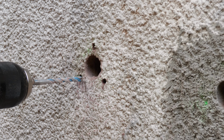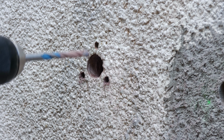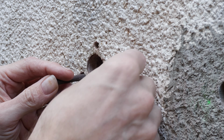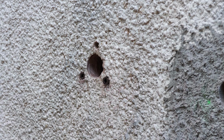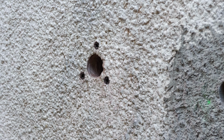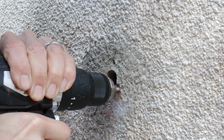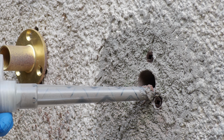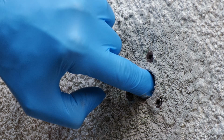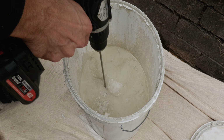And as the brass screws I had lying around have quite a wide neck, I even slightly widened the start of the hole to 8mm to minimise the chance of the screws blowing the render. As with the 24mm diameter hole for the water pipes, the screw holes were quite close to the edge. One hole on the repaired section did blow, so I increased the angle of the hole and repaired the surface with the Metaset epoxy resin crack repair filler that you'll also see in that crack repair video I just linked to.